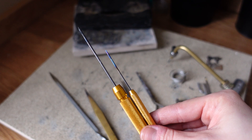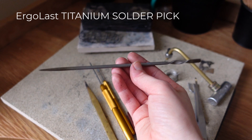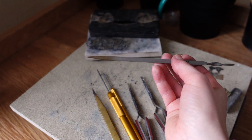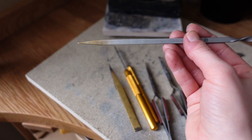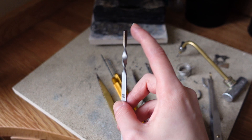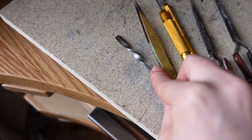I've been using both the larger and smaller Pepe Tools solder picks and I'm very happy with them. There's also a new titanium one — you can heat the tip but it doesn't conduct the heat, so this part stays cool and you won't burn yourself. It also doesn't bend when heated, which is important when you need to push while soldering. You can use the top to pick and place solder, and the bottom to keep something in place or press on it. It's also extremely light.